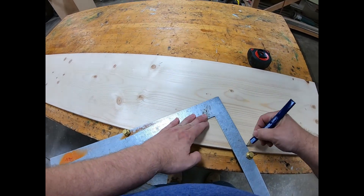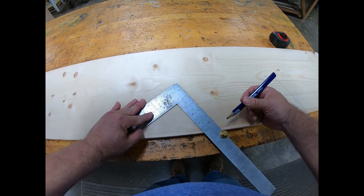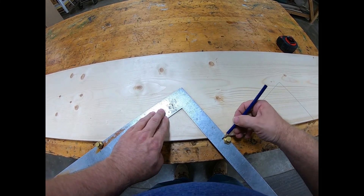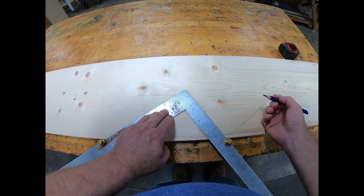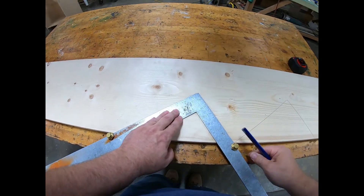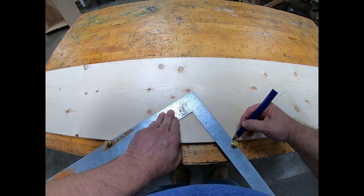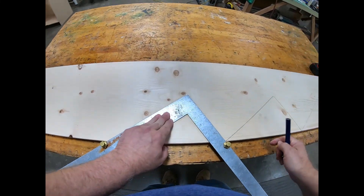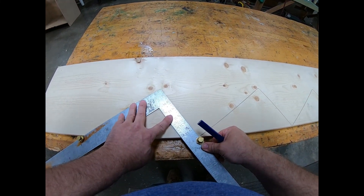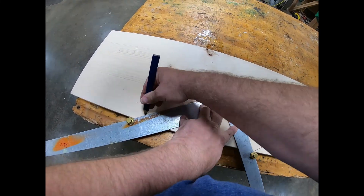All I have to do is mark along the edge of the framing square. I'm going to line this up so this line right here is right on the edge of this stair gauge — they have to be right in line. Sometimes you have a curved board and it'll throw it off if you don't. Mark it, then slide it down to the next one, making sure the line is right in line with the end of that mark. On a big staircase you may have to do this 14 or 15 times; on this short one you're only going to do it half a dozen or so.